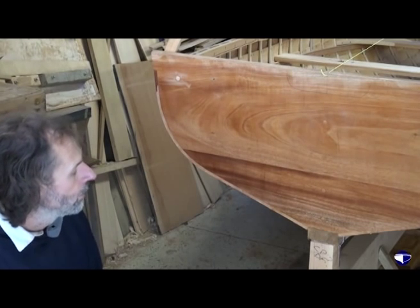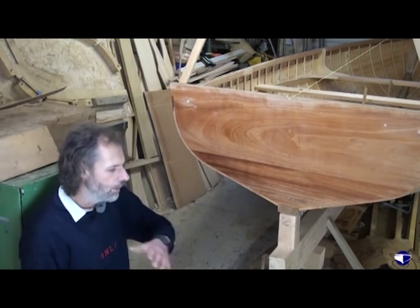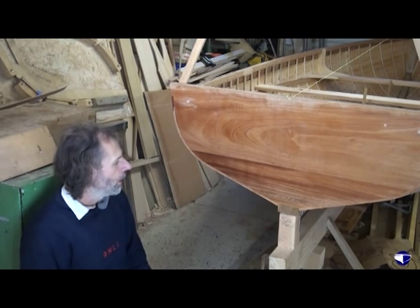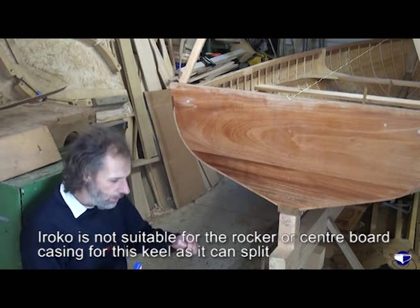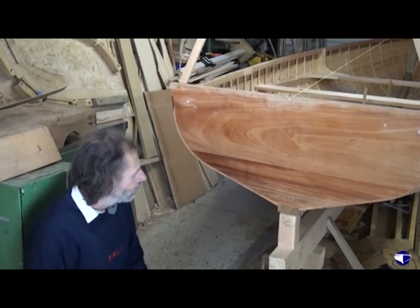Most timber can, really. But on this sailing dinghy, the keel has got a rocker so the keel is bent to shape and it's also got a centre plate slot cut in it. I have had trouble with Iroko before — being bent and having a hole cut in the middle of it, it does tend to split away from the cut out. Which is why I prefer a nice piece of oak.